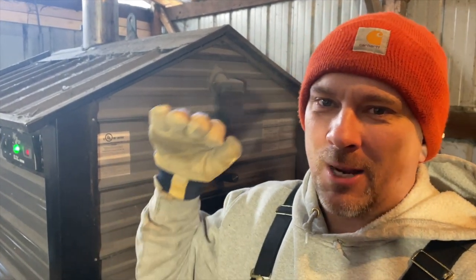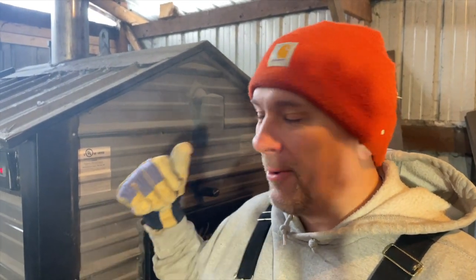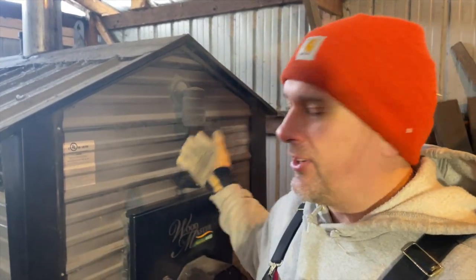So that's the reason why I prefer smaller, fully seasoned firewood in my outdoor wood boiler. It brings that water temperature back up very quickly and burns great. Right now that fire has no air so it's not really burning, but when the blower turns on that seasoned, smaller-split wood is going to burn great and bring that water temperature back up in a short amount of time. To me that's the most efficient way to run an outdoor wood boiler — I wouldn't want it loaded with big green chunks with the blower running for an hour and a half trying to get the wood burning.